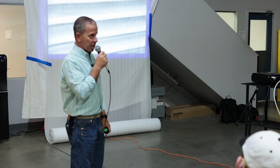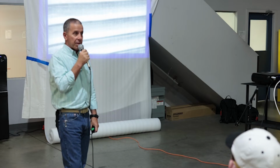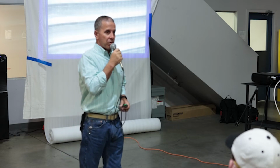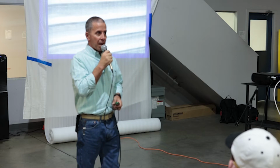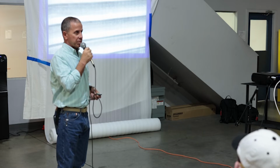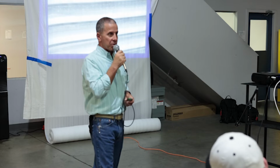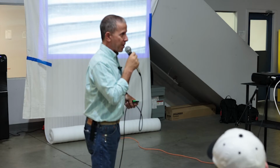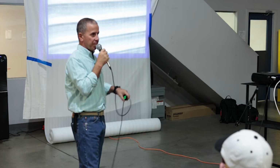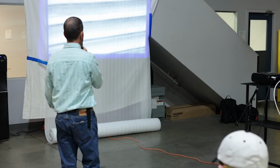Again, you build aluminum boats, you see this stuff all the time. That aluminum oxide material is not harmful to anything. I mean, it's a byproduct of aluminum being exposed to oxygen. It is the film that gives aluminum its corrosion resistance, this aluminum oxide. And it is so hard, in fact, that it's used as an abrasive. You can buy sandpaper that is aluminum oxide. So it is quite resistant and durable on its own if it's not in contact with other metals.